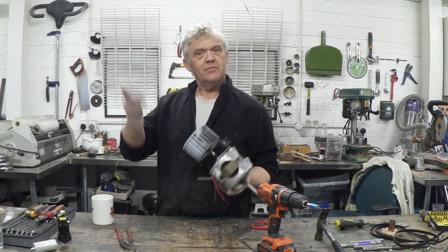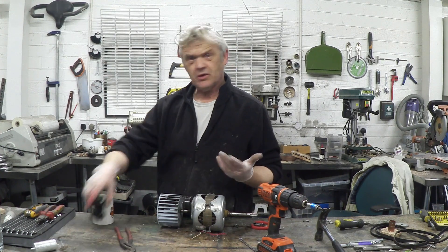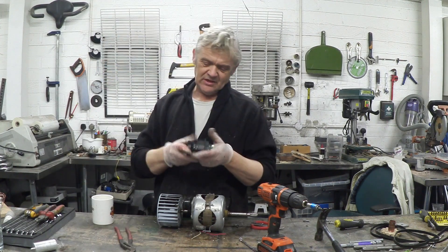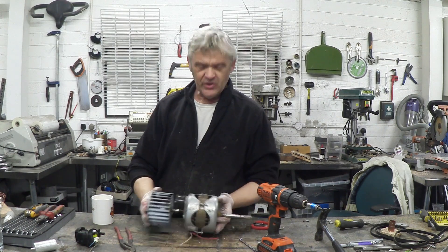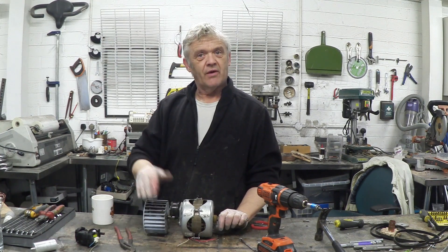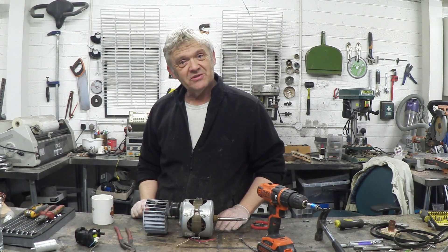Here is the motor with its impeller removed from the case. I also removed the sump pump incidentally, because we've made things from one of these before, so I'm going to have a look and see what's in there that could be interesting. This is a shaded pole motor, which is no surprise if you think about it — it's a very low torque application, just driving some hot air over a rotating drum. Anyway, let's get that motor to pieces.